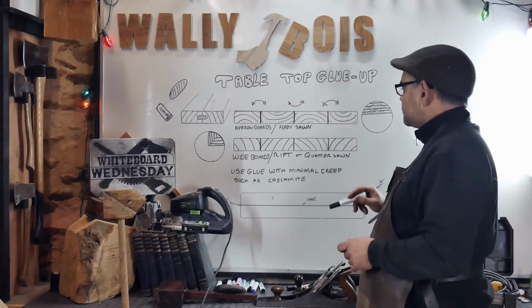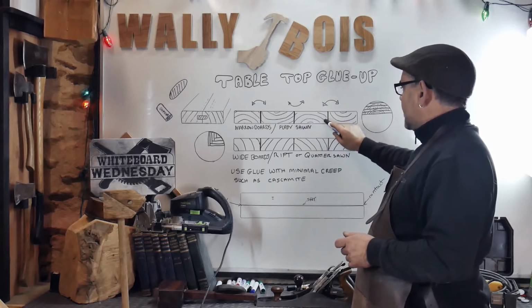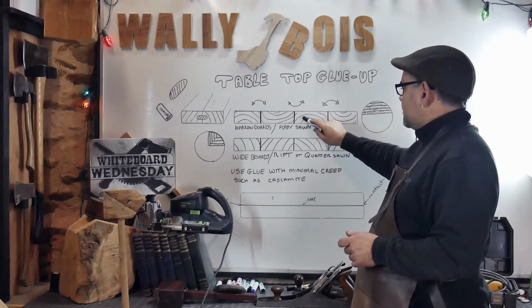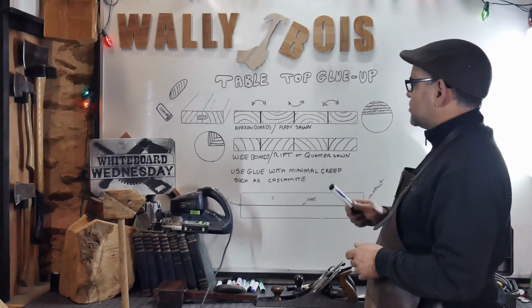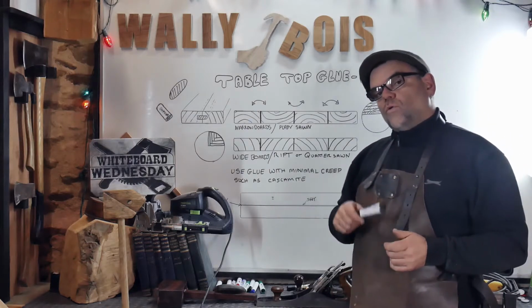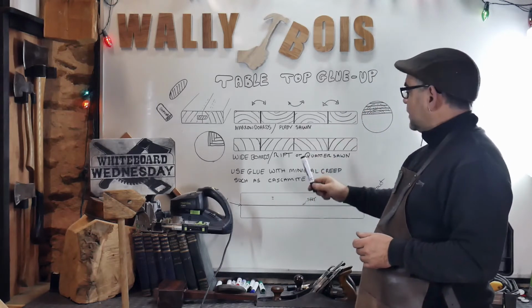This type of grain pattern can cause stresses and strains in the timber. Where the grain is effectively is where there will be more resin. In between that, you'll have the softer heartwood, and this piece of timber in between the grain will shrink to a degree and expand to a degree, and that causes the stress and the strain. So what we have to do is orientate our boards in a certain way. That is more important with this grain pattern than it is with this one.